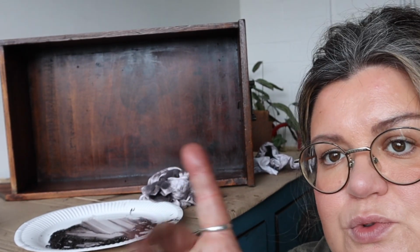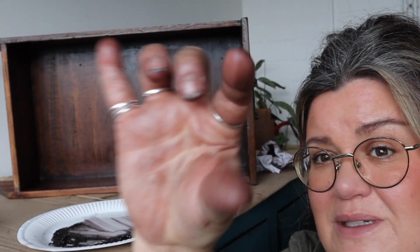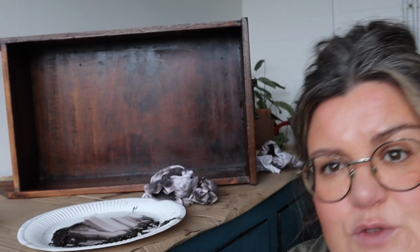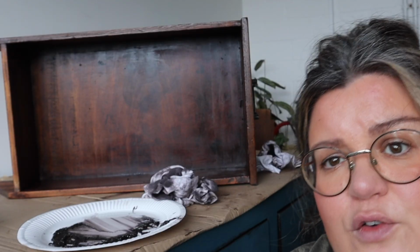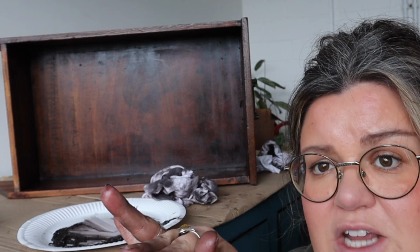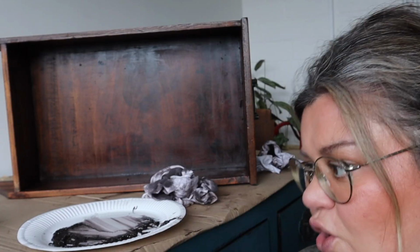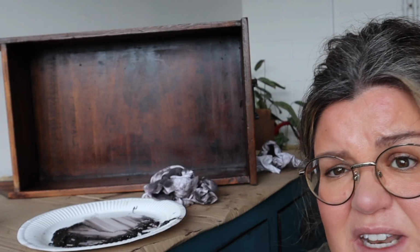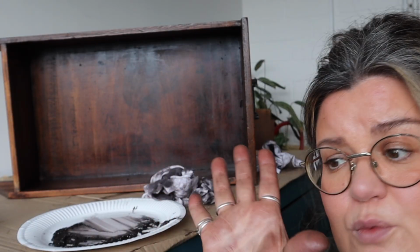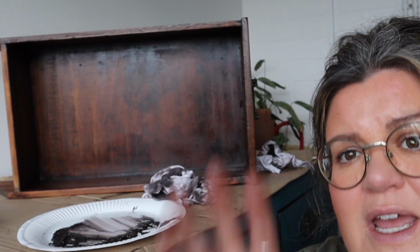And then the golden rule with any wax-based product, and this goes for Big Mama's Butta, it goes for Best Dang Wax, it also goes for those little pots of deliciousness Gilding Wax. If you don't buff the excess off, you won't get a sheen and you'll leave too much product on the surface. So the nature of how you apply wax is that you put too much on, you remove the excess off. Removing the excess is going to give you that nice even finish. It'll allow the product to have the correct amount of product on the surface so that it can dry down and cure. If you leave it on without buffing, you will just forever have a tacky, sticky finish to your furniture. So like I say, that goes for whether you're using Best Dang Wax, Big Mama's Butta or Gilding Wax. Any wax product requires buffing.